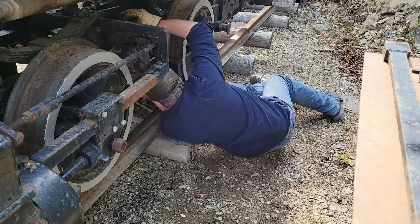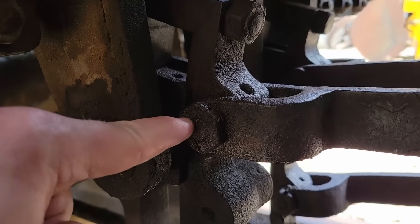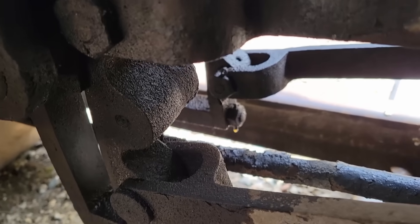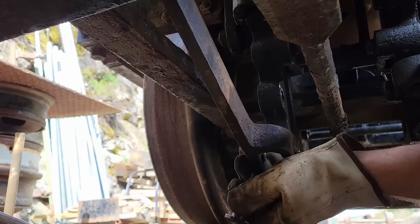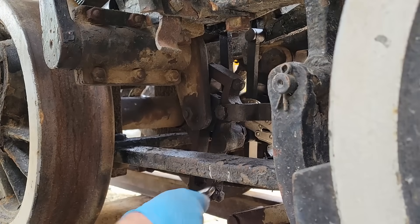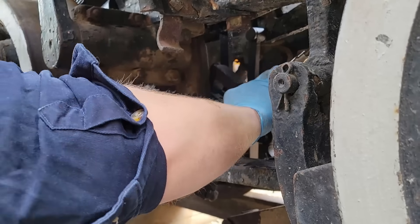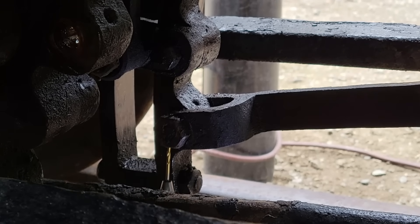Moving over to the Stephenson valve gear now. Here's the underside of the four eccentric straps, each with a hard-to-access double-nutted bolt. The eccentric blades are attached to the links with threaded pins and held tight with one nut each. The nuts should each have a cotter pin to keep them from coming loose, but as usual, some do and some don't. The pin head is completely round, so vise grips are used to hold it while the nuts are unscrewed. Everything is coming apart as though it was assembled yesterday, and I have a feeling these pins were renewed at least once during the engine's working life. Things would be far too easy if I didn't have to drill out at least one cotter key.